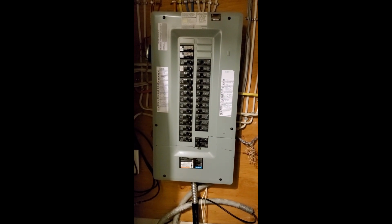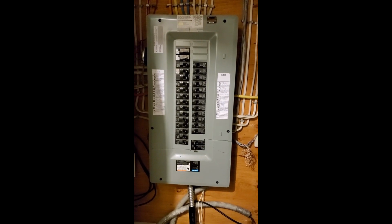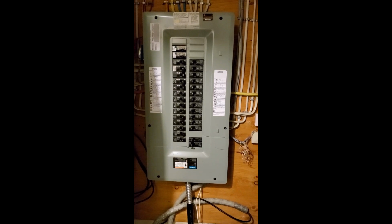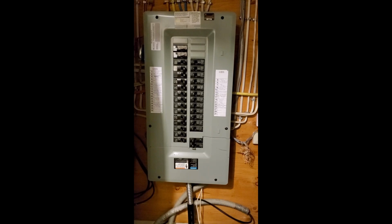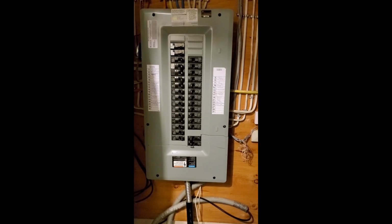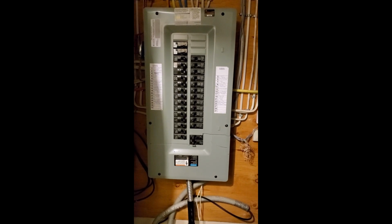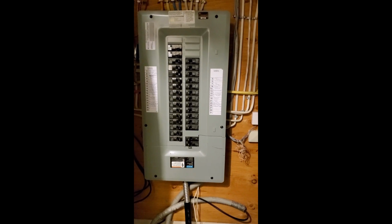Now we will try to find out if my transformer unit is compatible with Google Nest Hello. The minimum requirements for voltage for the Google Nest Hello wired version is between 16V and 24V. So anything lower than 16V or higher than 24V is not compatible. For power, it is 10 VA to 40 VA. So anything lower than 10 VA or higher than 40 VA is not compatible. And we are talking about the wired version of the Google Nest.